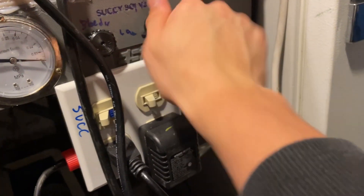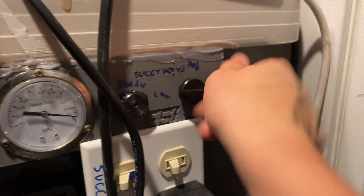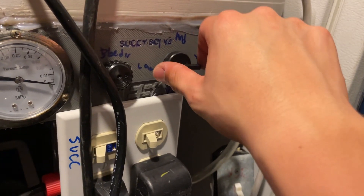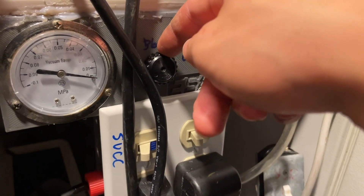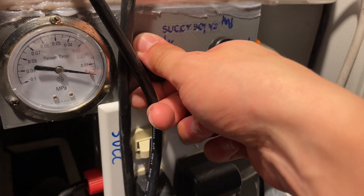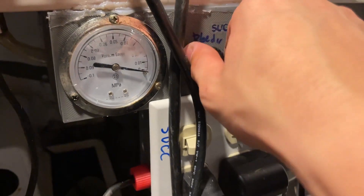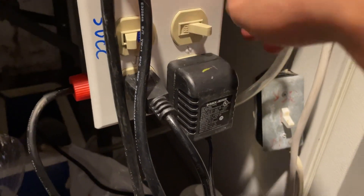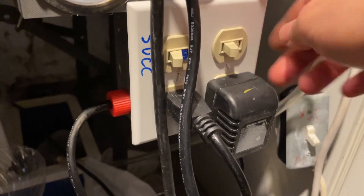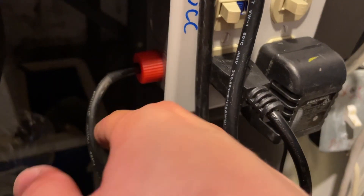The manifold has vacuum, off, and low vacuum settings. There's a lock position where it shuts off from the vacuum but keeps whatever it's on. This is a PEX push-bite ball valve that I hacked by drilling a hole in the side — that's how I have so many settings. Here's a bleeder valve connected in parallel. This needle valve is actually out of a propane blowtorch. There's the vacuum gauge. I also built this switch box — it cost $46. I love inflation. Switches with outlets, cover, metal box, butane tank lid as a cord restraint. That turns on the vacuum pump.